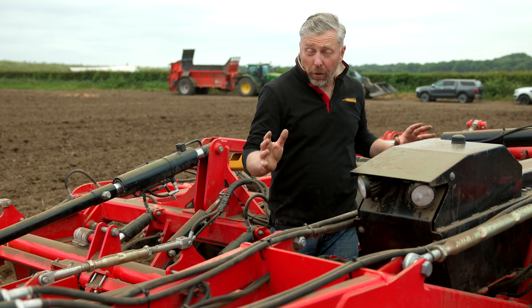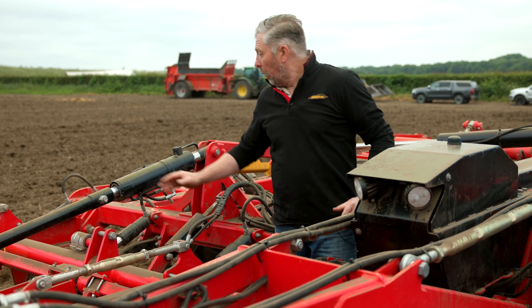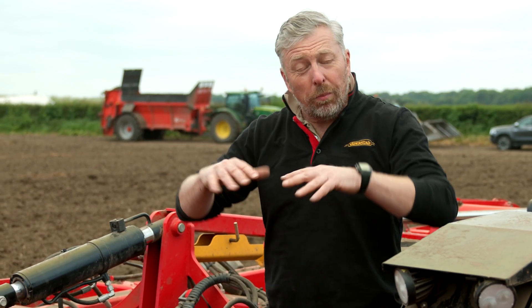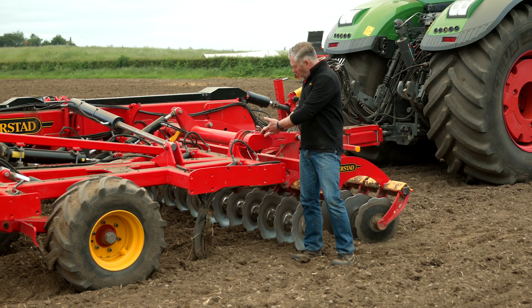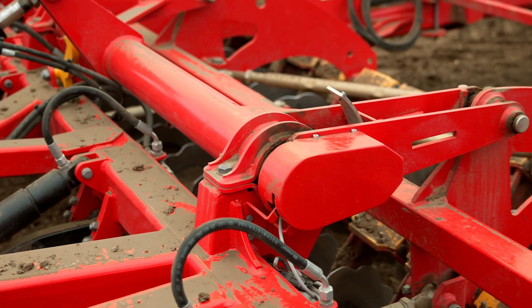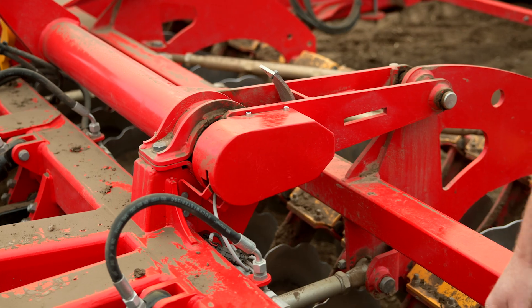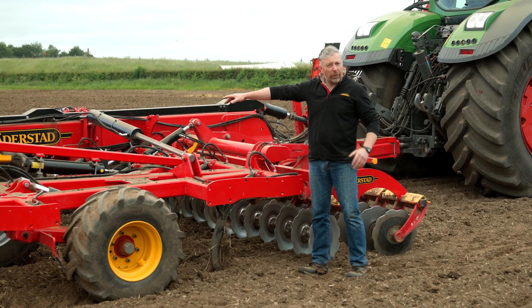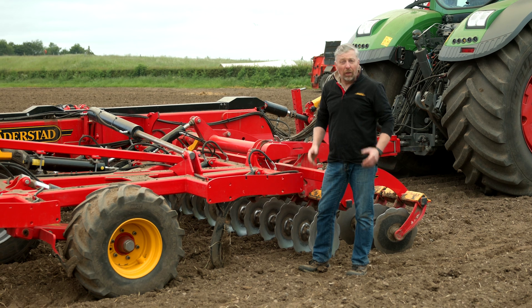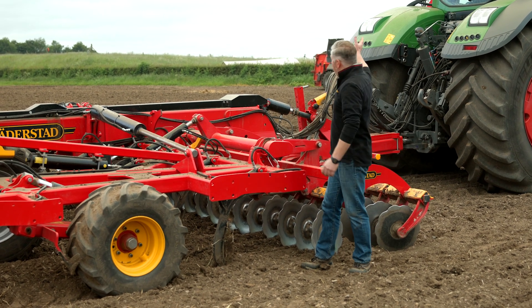This is a standard production top-down, however we've got two cylinders now designed especially for this e-Services machine, which gives us the ability to change the pressure on the rear steel runner or lift it off as needed. Under this cover is a radial angle sensor that tells workstation X the position of the system disc. We also have one on the wheel carriage for tine depth and one on the levelers — these tell the iPad and e-Services the position for each of those sections.